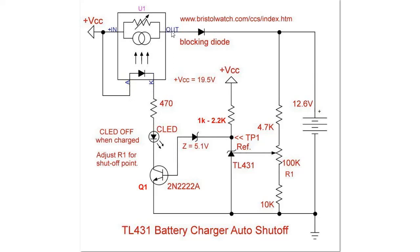What's interesting is that the particular test battery I used was a defective battery. Like most defective batteries, it would charge up to a point and you'd think it was charged — but then the voltage tends to drop back down. As it goes back down, the circuit immediately detected that, turned off, and re-energized all the circuits, turning the constant current source back on. As near as I could tell it was doing this about five times a second — just pumping enough current in to keep the voltage up at the set point. So it reverted to a trickle charge mode to maintain that voltage.